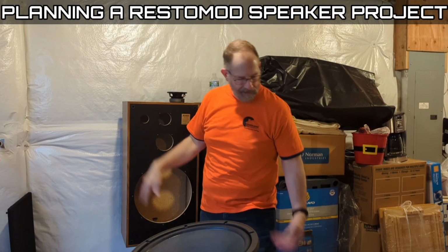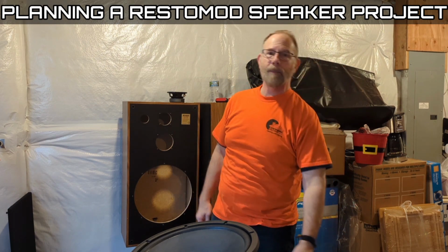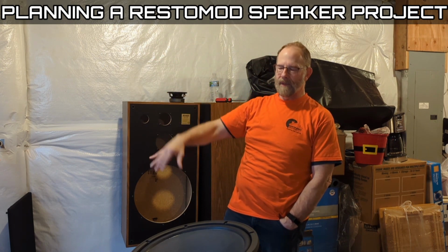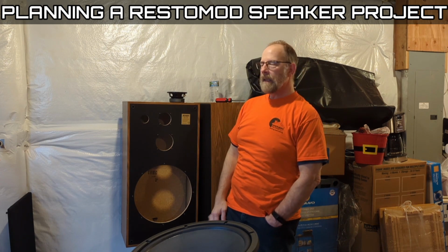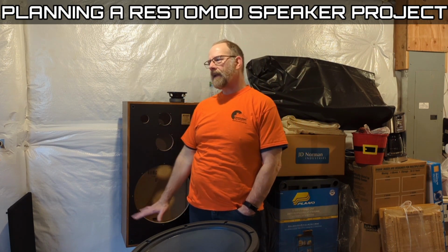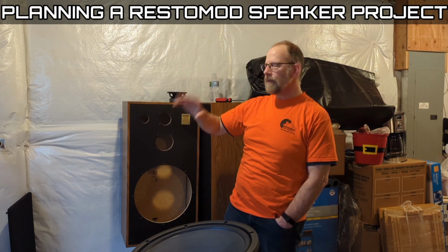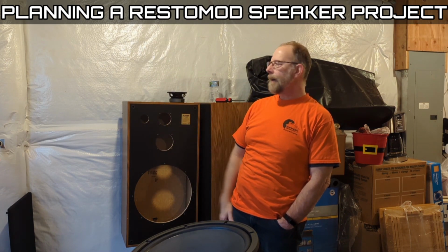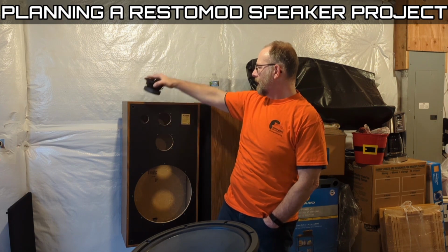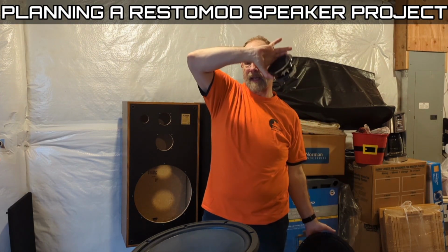The speakers that I had mentioned that I was building back in the day with these drivers, I was working them out to have about a 40 hertz punch. So really, at that level where most of your hard-hitting low basses are, that's where I wanted those to perform the best, and they did. This one here, I don't really necessarily need that. I need to go a little bit lower into the 30 hertz range with a roll-off that gives me some of the rumbly stuff. High end should be just a little bright, but still smooth, right? Mid-range should just fill in the gap at a decent level. But see, mid-ranges will have a tendency to always sound a little bit louder. Don't ask me why. Really important, again, to get this guy right and that guy right.